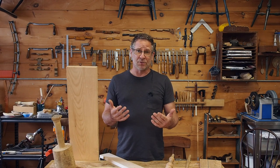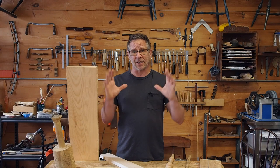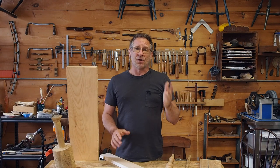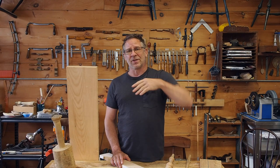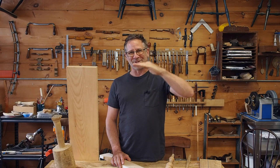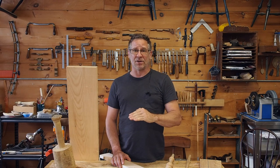If you wanted to, and you were doing some specialty sawing, you could take a tree and actually come in from all angles with the saw so that you end up cutting all the boards either quarter or rift sawn all the way around. That's very different than through sawing where you're just gonna cut from one top surface and just keep doing it like it was a stack of cards, for instance.